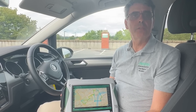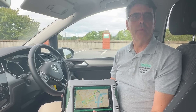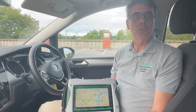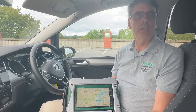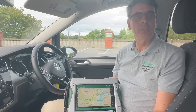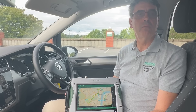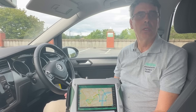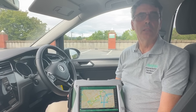We started off today by using the standard spectrum analyzer to look at the six 5G networks here in central London. We could see all of those networks and then we went into the carrier aggregation mode to do a standard basic demodulation of each of those networks, so we could see the local PCI, the signal strength, the frequency and the overall summary of the performance of each of those networks at a single location. Then we went into the coverage mapping mode, drove around central London and plotted on the screen the signal strength for one of the networks across a wide area — and you can see that this particular network at three and a half gigahertz really has very good coverage. So we've done a lot today, it was very interesting. I hope you enjoyed it as well. Thank you for watching.